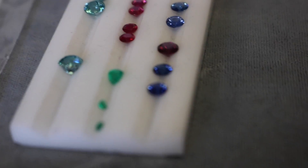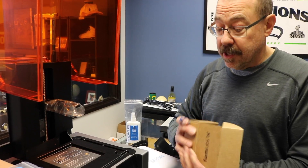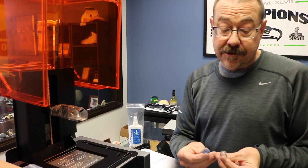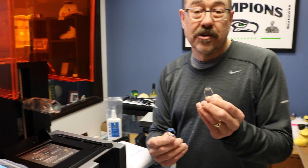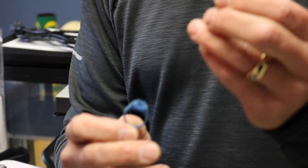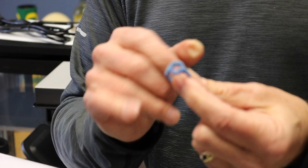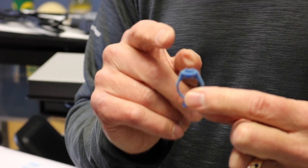The build plate slides on here, then the plate dips down into the resin, lifts out repeatedly, and grows the piece from the bottom up. Pretty cool. At the show, Formlabs had a promotional kit with a couple of different wax samples. This gray wax is super durable — customers can try it on and they're not going to break it. But this is the castable wax, and that's the important one for jewelry casting.